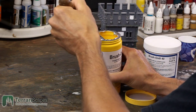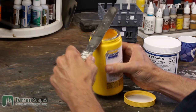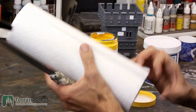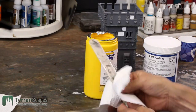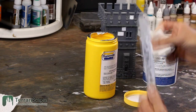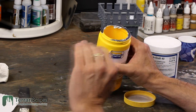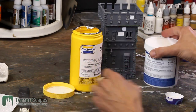The main reason you want to mix Part B thoroughly is that as the urethane ages, urethanes really react easily with moisture — including moisture from the air. What happens when that occurs in this component is it begins to crystallize, and if it's really bad the entire thing will become a solid block — completely unusable. I can already see on the top when I open it that there's a very, very thin sheen of crystallization happening already.